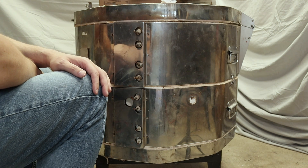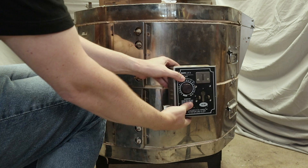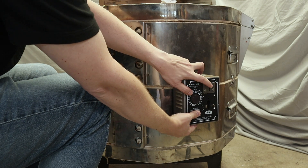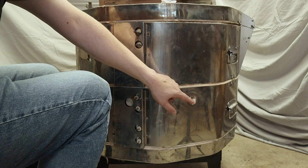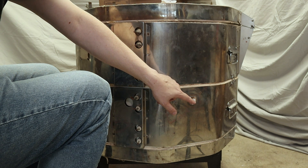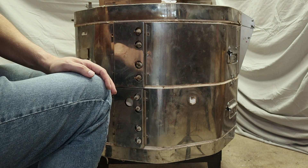The first thing I'm going to tackle is the thermocouple. This here is the hole for the original kiln sitter. The kiln sitter used to sit here and there was a lever that came through this hole. In the last video I took a piece of ceramic fire brick and cut it down to make the hole smaller so I can actually fit the thermocouple.